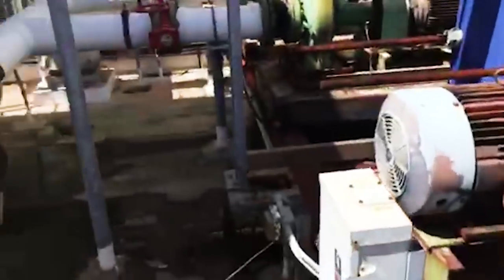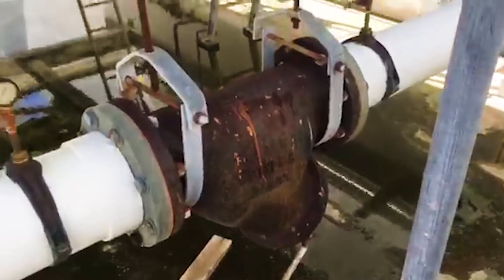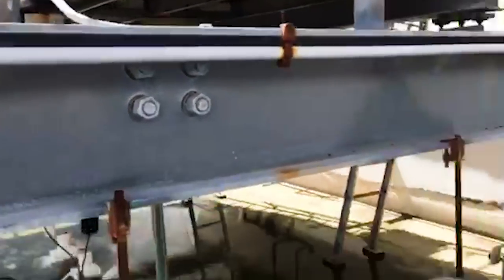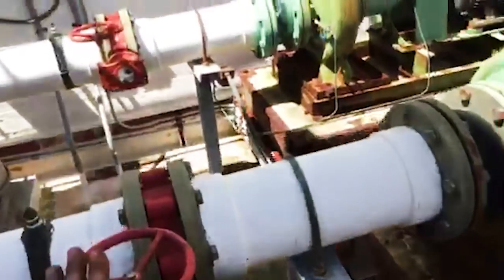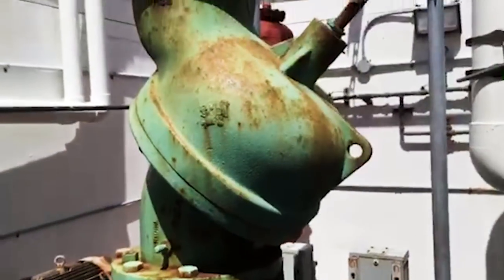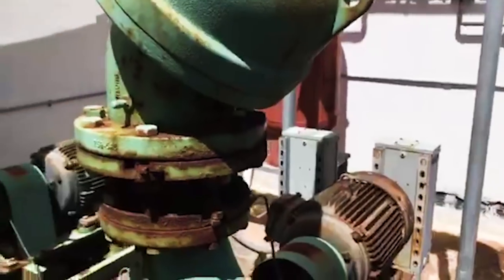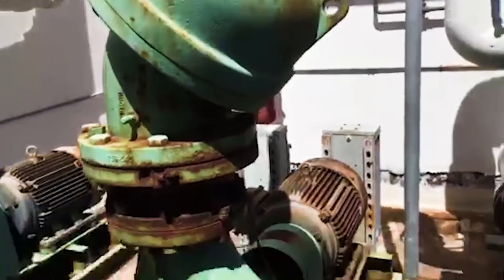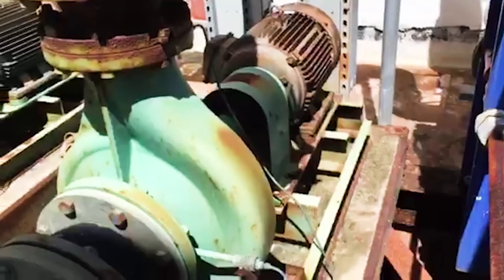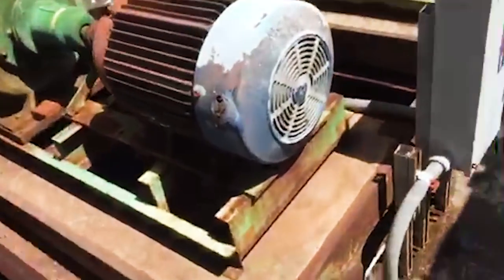Usually you see strainers on the pumps like these have. This is our closed loop. These are our tower loop pumps — there's a strainer here for the tower loop, and there's probably also a strainer in the tower before it comes out. You've got some shutoff valves here if you need to isolate a pump. And here there's a check valve and a circuit setter, so you can adjust the stem to restrict that opening, which will drop your pump amperage and lower your water flow.